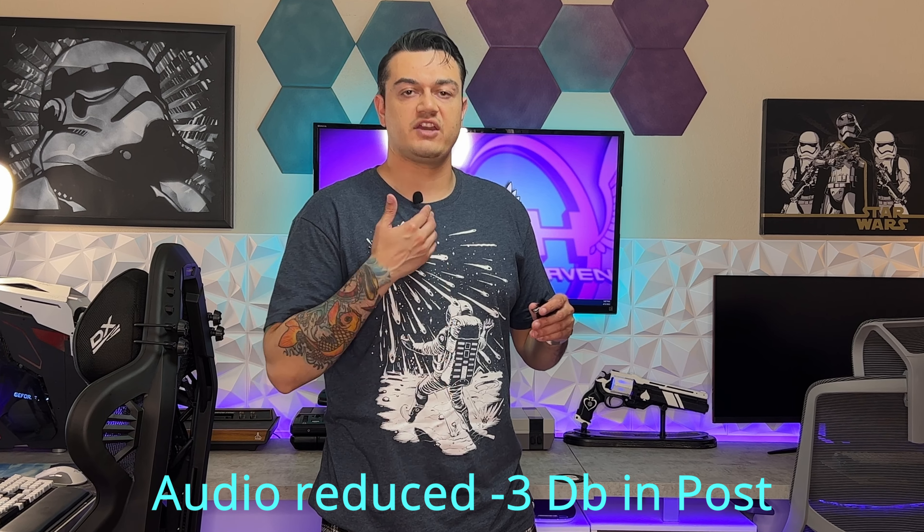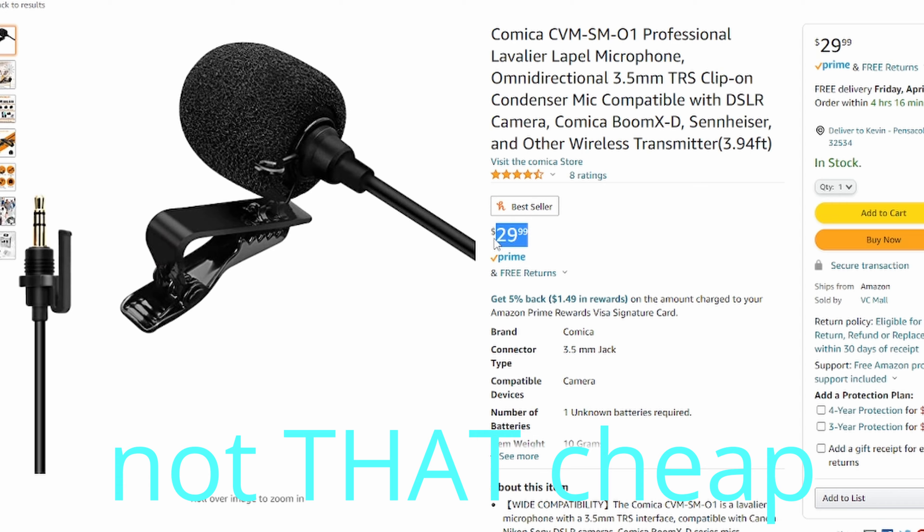You also have a hot shoe — or maybe cold shoe, I don't know the temperature — but it's a shoe mount for something like a DSLR camera. Then you have a 3.5 to 3.5 millimeter audio jumper labeled for camcorder. And this was very interesting: there's also an XLR to 3.5 millimeter adapter. An important note after reading the manual — that XLR cable is to go into the XLR inputs on older camcorders. You cannot use it as an input for an XLR microphone. Condenser mics require 48V phantom power which you wouldn't get from the battery-powered transmitter, so the XLR cable is to plug into a camcorder to record audio, not to use an XLR mic.